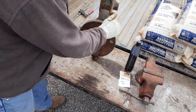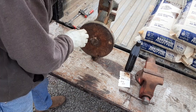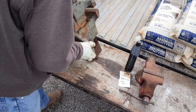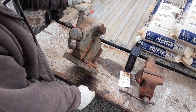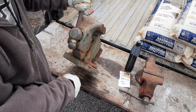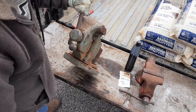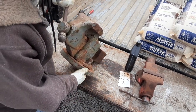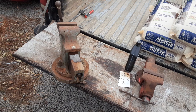Someone drilled and tapped some holes here. I'm going to go ahead and do a little bit of disassembling on this and see if it will still swivel. They had welded it at some point and it looks like it broke away. I'm assuming this plate is a piece of steel, but I'm not sure because the weld is stuck to the steel real well but broken away from the cast iron. I'll pause the camera and go grab some tools to start disassembling this.